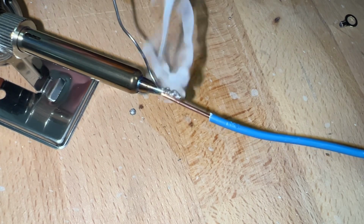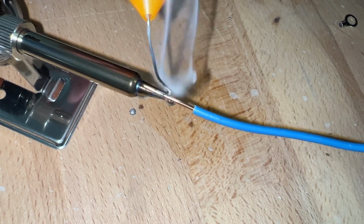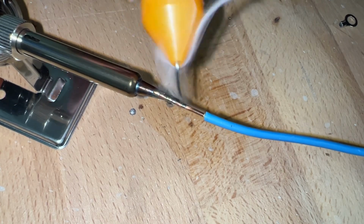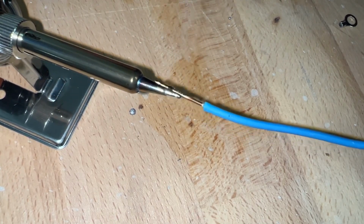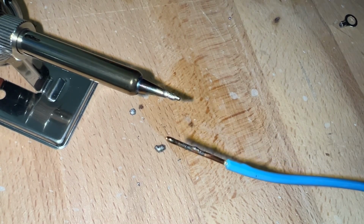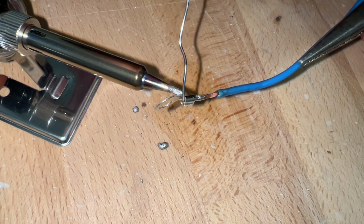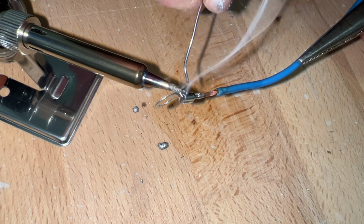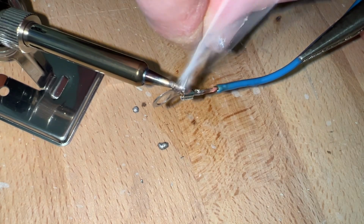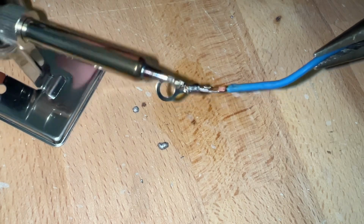Okay. Once our iron is heated to the appropriate temperature, we pick up the iron by the handle in one hand and hold the piece of solder in the other. We hold the hot iron to the place where the 2 metal components will meet for about a second to heat them up. We want to heat the metal parts, not the solder itself. Then we touch solder to the heated components.